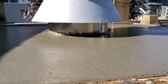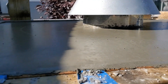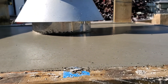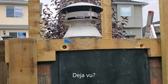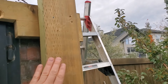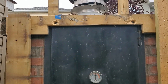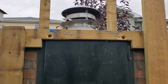Here we go — all the finishing work is done. A little bit of ash seems to have blown up on here but that's okay. I'm going to let this set and cure for a couple of days and then I can get these forms off. It has been a few days and it is time to get these forms off. I'm going to start by just pulling off these vertical supports, taking the screws out, and we'll possibly hold on to the forms running around the perimeter so it can't shift around, and then we'll hammer them off.